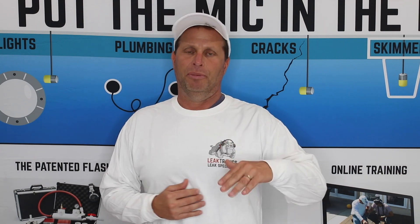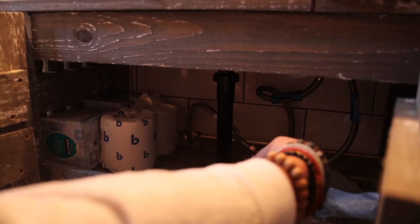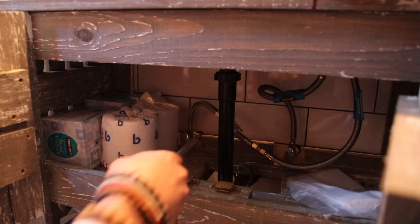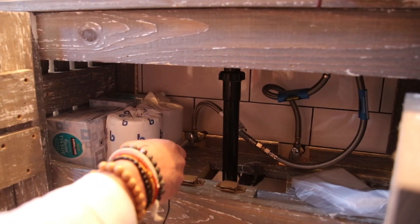We're shooting this video to go over some pressure testing tips — not just for pressure testing, but for putting a line under pressure to actually be able to hear a leak. So let's say we're in a tight spot, in a bathroom, listening underneath the sink. When we touch that stub out, we're going to hear it with the pipe probe — we're going to hear that sound of running water in a pipe. That's the sound of a leak if everything is off and not running.